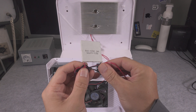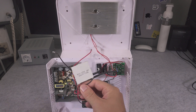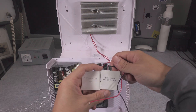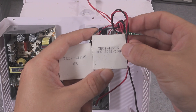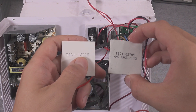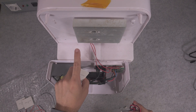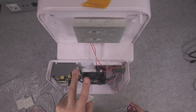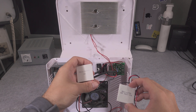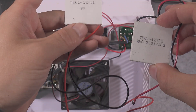The replacements just arrived. The simple thing I can tell you: the last digit '05' means that this device is going to be pulling 5A. You can get more powerful modules, but as you go with more current and more power you need to dissipate more heat on the hot side — you cannot go indefinitely, you have to scale up your heat sink and cooling capacity. So I went with a one-to-one replacement and we are going to swap it right now.